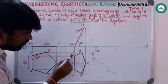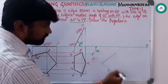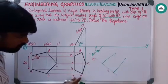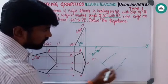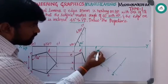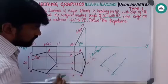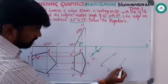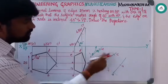From all these reference points 1 to 3, draw 90 degree lines. After drawing the 90 degree lines, measure from 3 to b — which is the same as 1 to d — and cut an arc. Then measure 2 to c and cut an arc. Join all these points — e, a, b, c, and d — to get the pentagon.